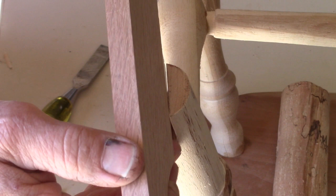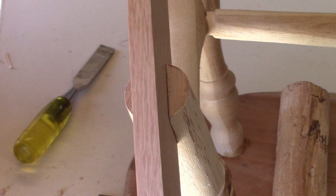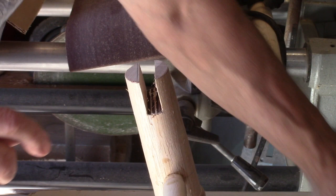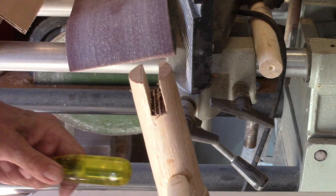Now I'll clean those out with a chisel that fit. You don't want to have to force it — if you do, you may crack the leg. The saw is undercut so it has to be shaved with the chisel. You can see my scribe line; I only need to remove half of what's showing.